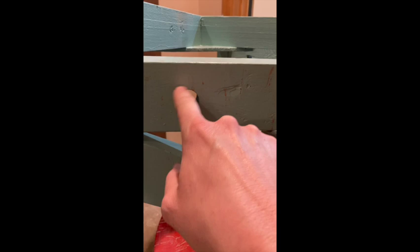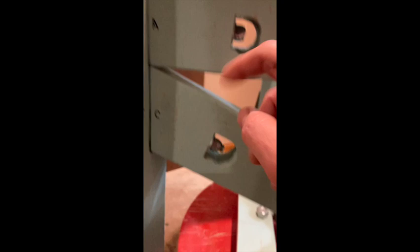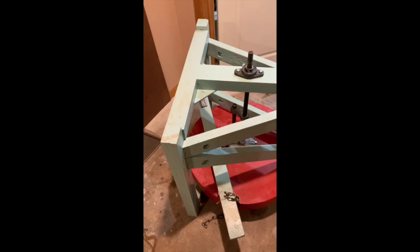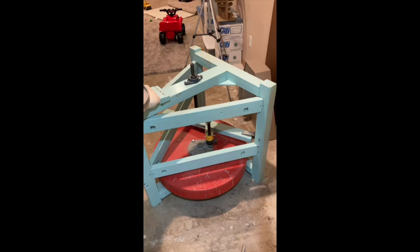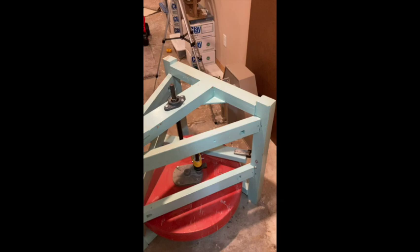What you do is drill a hole with a Forstner bit the size you want, then take your chisel and square out one part of that hole so the washer can seat flat. It's not perfect — it's jagged in there — so you just do the best you can. All these angles and stuff, I was winging it every single time — every hole is different. These two here are a little tricky because they can't be at the same spot; they have to be slightly offset, otherwise the bolts would hit each other inside. Is it hard? Yes. Is it also not that complicated? Yeah — it's not. It's doable. It is a big project, but anybody can do this. It's just confusing because you see the whole product and it's not broken down very easily. Just do what works for you. Using pine is a lot cheaper than hardwood.